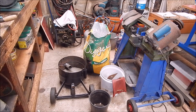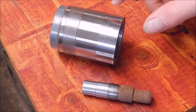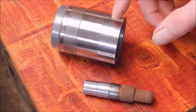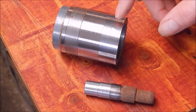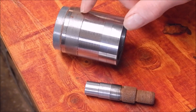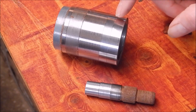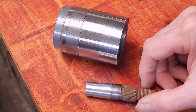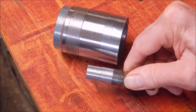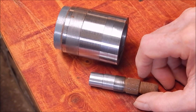While we're here, an update on that carbide insert for aluminium. I had a bit more of a play around with it after I did the video. Here's where it did a really nice job on the treadmill roller — this is quite stringy steel. You can see it was streaming, and that's to do with the steel, not the insert profile. I've never been able to machine this without getting streamers off it. But the factory finish — we did a lot better than that, even with a normal TCMT. When we went to the aluminium insert, that did a mighty good finish — that's fantastic. Then on some really basic mild steel, you can see it's done a nice job — that finish looks pretty damn good.